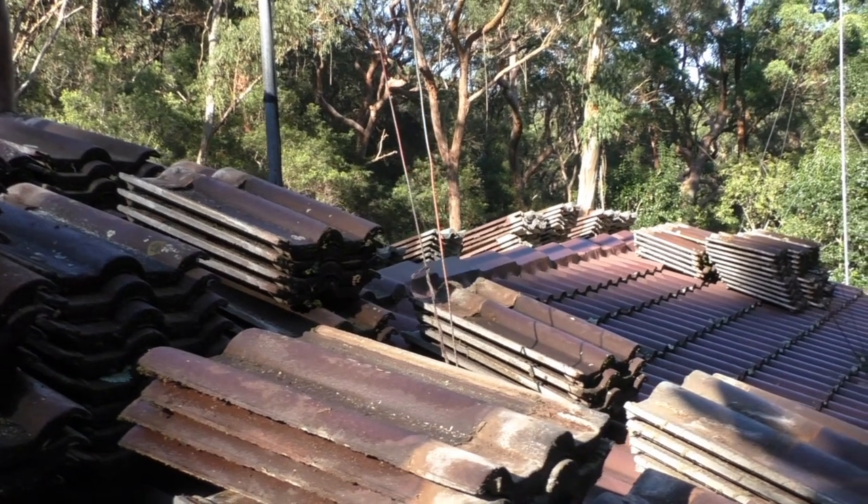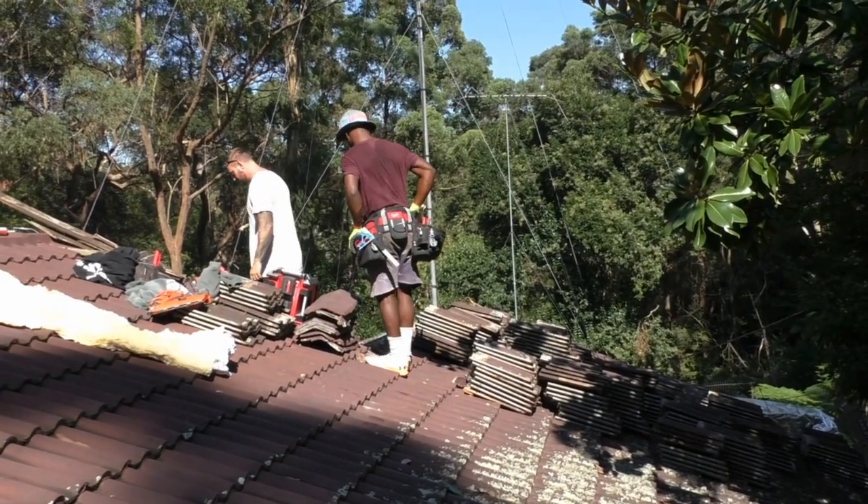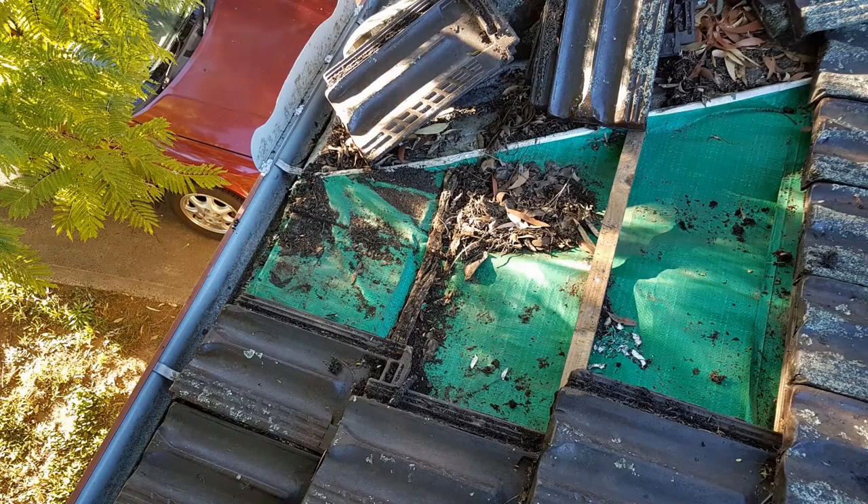The main reason for this roof being replaced is that the tiles leak. Where you have a really leafy suburb, you have a lot of leaf debris on the roof. When you have leaves on a tile roof, and if the tile roof isn't really a steep roof, you get a lot of leaks because the debris gets into the water courses and blocks the water flow. And if you've got a big tree above your roof, branches fall down and you get holes in your roof. So in this particular instance, they just got fed up of all these problems with the tile roof and said, give me a better roof — and a better roof is a Colorbond roof.